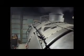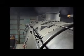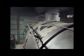Without that heater there, the water would be injected cold thanks to the pump. Usually when you're just standing still like this, not as much exhaust gas is being produced because of the steam. So you don't want to run the cold water pump while it sits there. That's when you run the injector.